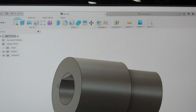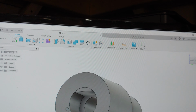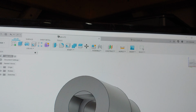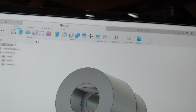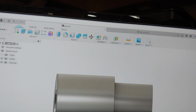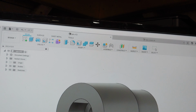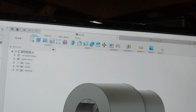It's a little bit tapered, so just scrape this edge a little bit. If this edge right here is not sitting flat against the top of the sprocket or the pulley, go ahead and take a tiny bit of this off, not on the flat side, just on the other part, and that'll jam on. The other thing you can do is, right when it comes out of the printer and it's still hot and sticky, you can jam it on the motor and form fit it that way. So basically, you're gonna press and pull this if you need to shorten it. You shouldn't have to shorten it enough where you have to mess with any of this hole.